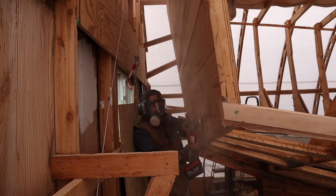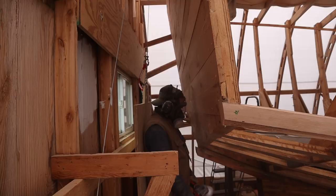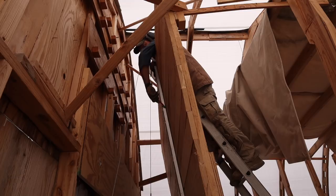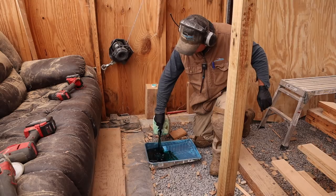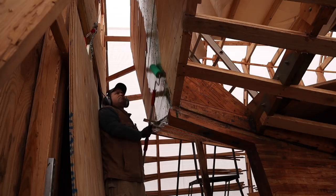Once all the solid wood planking is on the sides and on the bottom, we'll come back and install the final layer of finished plywood on the transom, and then we can move on to adding the plywood to the sides and the bottom. In my mind, this process is very similar to a shingle style house where you weave the corners, overlapping material which blocks the ingress of water. Now obviously we have layers of tar, and then with the plywood they will be epoxied into a monolithic skin, but putting actual physical structure between the water and the boat is a good idea in my mind.